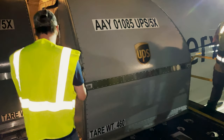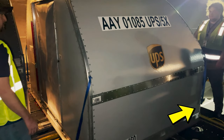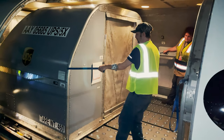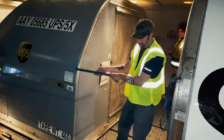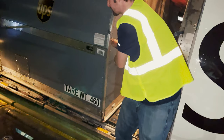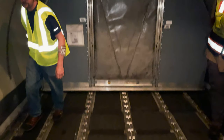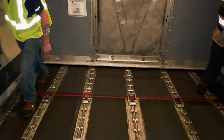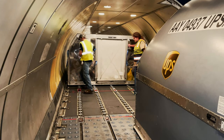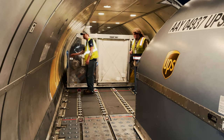When unloading the topside of a 757, make sure you stay in the safety zone of the K-loader while position 3 passes onto the bridge. Beware of worker congestion when removing position 2. The employee working the door should be extra aware of the distance between the K-loader and the sill guard of the aircraft. Whatever lane you are pulling from should be the lane you pull from for the entire unload. Notice where the red line is and use that as your safety zone. Follow step unloading procedures and stay aware of raised locks.